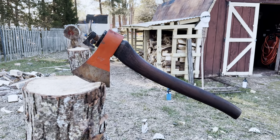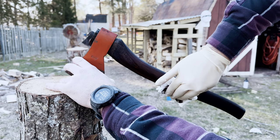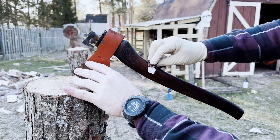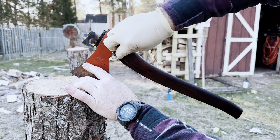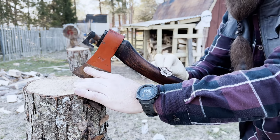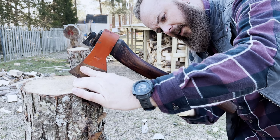And what you're doing is basically just taking off some of the finish, and you'll get a lighter color, okay? Kind of play around with it a little bit. Give yourself some depth in certain areas. You can leave some areas darker, leave some areas lighter. And you just kind of go through and rub this handle with this fuel alcohol here.